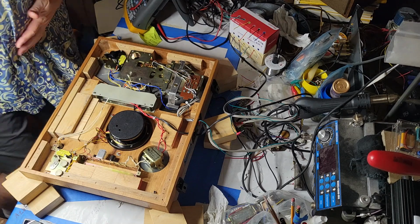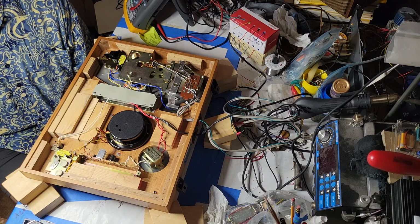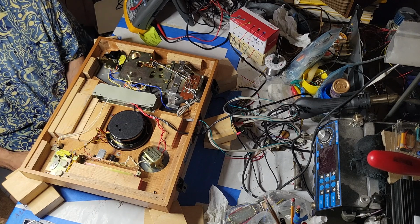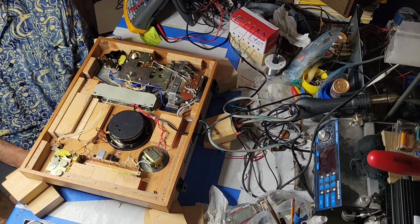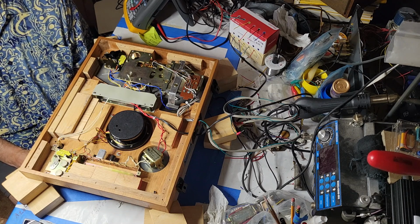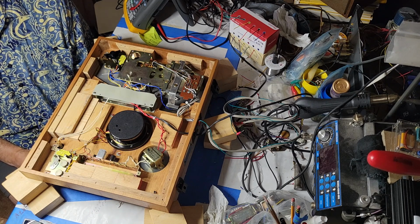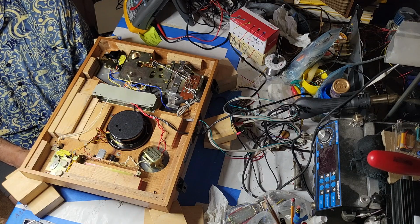Oh, I also found the bit in the service manual that talks about servicing the motor. It's under speed adjustment. Note, the DC motor assembly is precision assembled and adjusted at the factory. Never try to adjust and/or repair. Should the motor be defective, replace entire motor assembly. They say that after they give instructions for adjusting the variable resistors on it, as I was just doing.